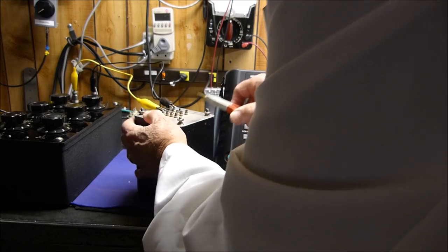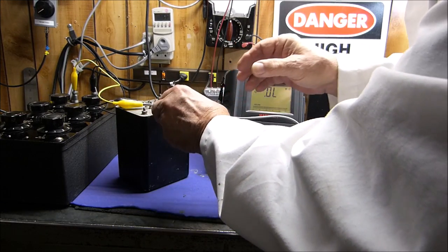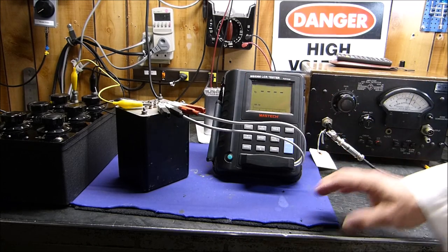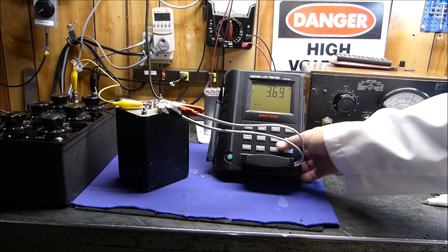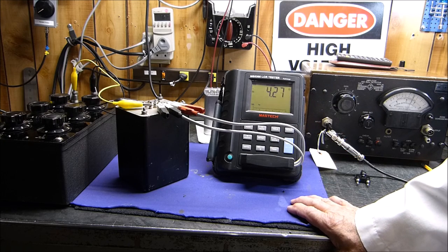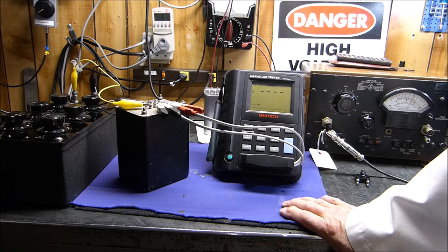1 and 3, 1 and 3, and 10 and 11. I said 8 and 9, I meant 10 and 11 here. And then let's hurriedly go back to 100 hertz. Okay, this is a massive transformer, and this should be 8 ohms, and it's 3.5. This is some of the stuff that I've been measuring. So why is this big, massive device 3.5 ohms at 100 hertz? At 120 hertz, it's about 4.5. At a kilohertz, just about everything turns out perfect. Oh, please.